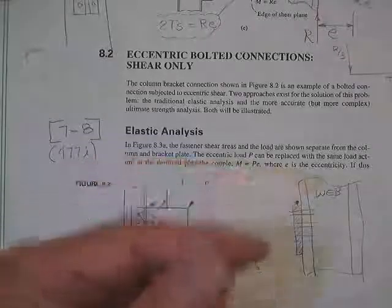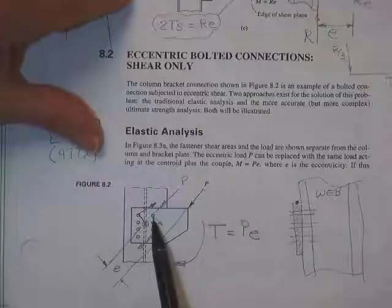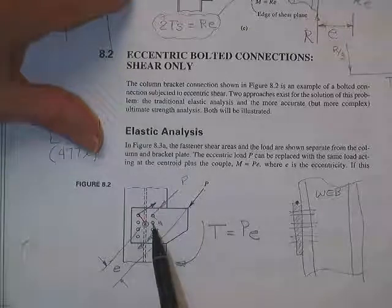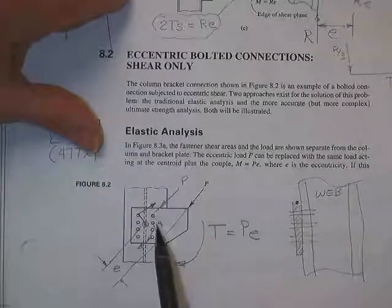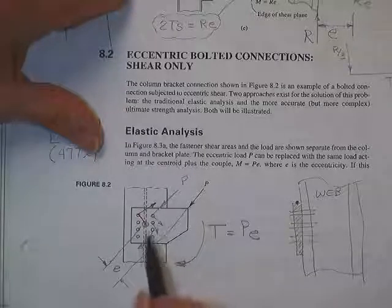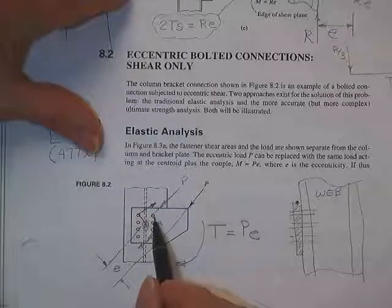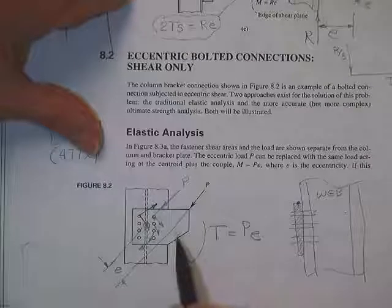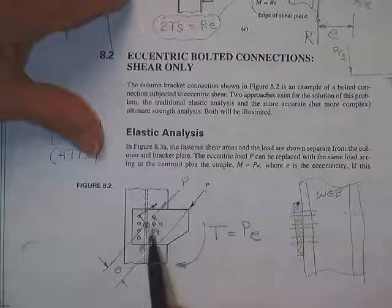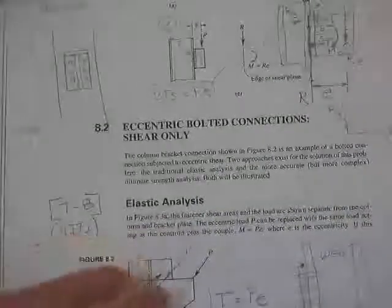Now that leaves us with a lot of strength there that we haven't accounted for. Number one, the fact is this bolt can yield, it can go past yield, allowing the next bolt to yield. And then he can yield, and then the next bolt will yield, and the next bolt. And first thing you know, they may not all get to yield because, for instance, to get this one to yield, you might have to roll that plate 50 degrees. So when one of these bolts reaches a real honest-to-goodness max that we have to quit, then we'll quit on the whole thing. But believe me, picking up all these other people's additional capacity is quite an increase in a number. So we're going to have an elastic analysis, and we're going to have a plastic analysis. We'll work on those next time.